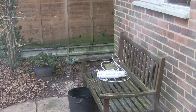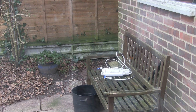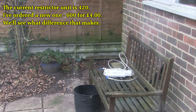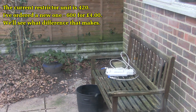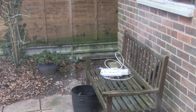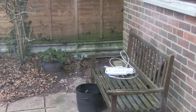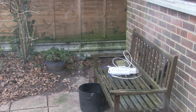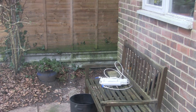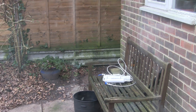A new unit is somewhere between five and ten pounds — it's not a lot of money. My problem is I don't know what size unit I've got; I'm hoping it's written on it. I've checked all the pipes and everything, and the way that external tap has been set up is just restricting the flow before it even gets to the RO unit. There's not much I can do about that apart from do it properly, which means shutting all the water system off — it's all under the sink with restricted access — cutting the pipe and putting a proper T junction in it, so it had the same pressure as the rest of the system.